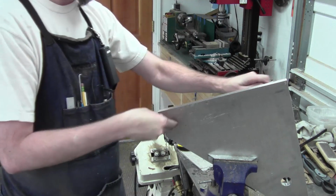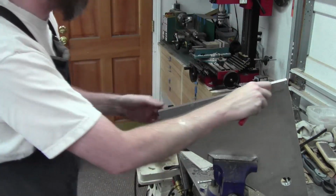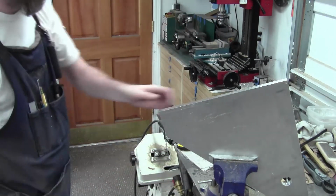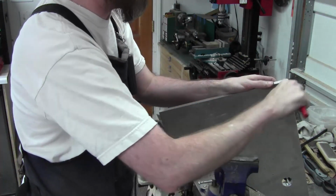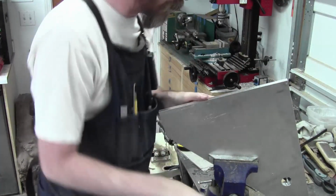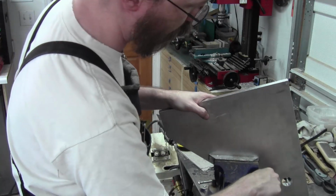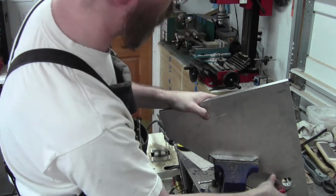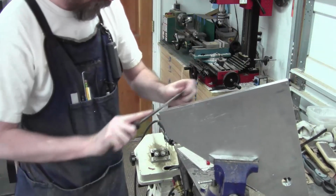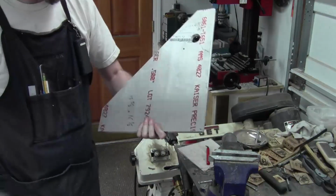Favoring the top a little bit. We'll favor the underside. That's nice. We'll do this side. There we go. You can even do these little holes. That helps a bit. Keeps the sharp burrs from cutting you all up. And there we go. Oh, we've got to do a little more there. You can kind of go in an arc shape when you do it. This is filed. This needs filing. And there we are, one other part completely set. Ready to drill all the holes that it needs.